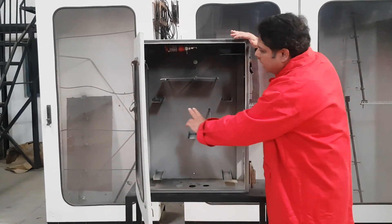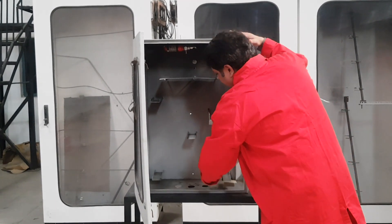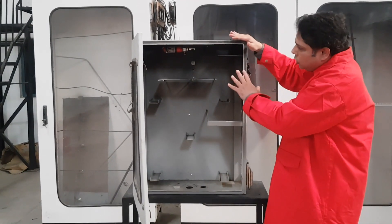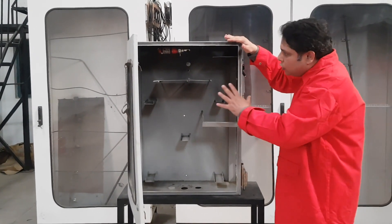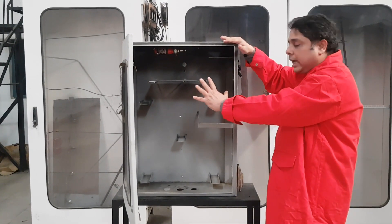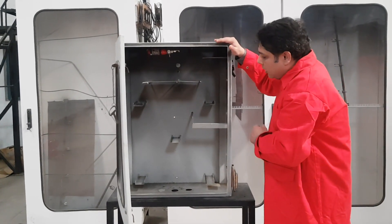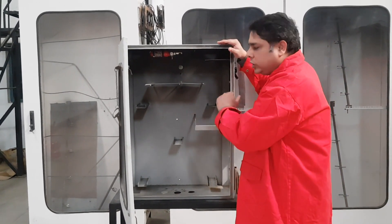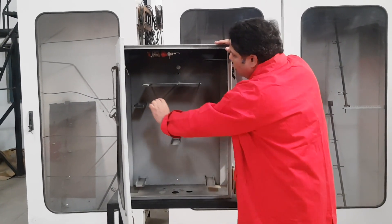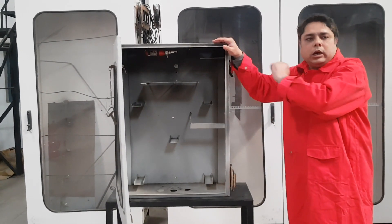I am going to place cups at 1, 2, 3, 4 and 5 locations. This should suffice to indicate that the gas totally floods the complete area and the gas allows for total extinguishment. So let's go ahead and look at this demonstration. I am going to place cups over here with heptane in them and light them and let the extinguisher work.